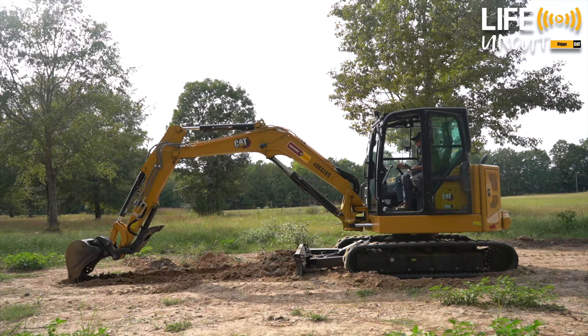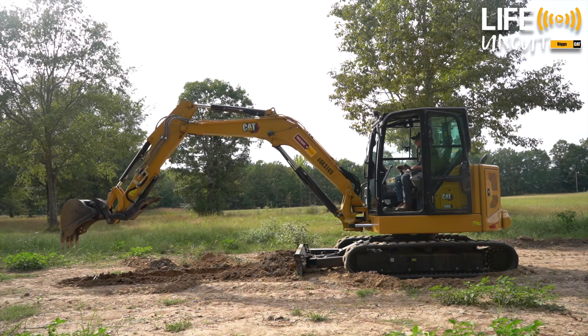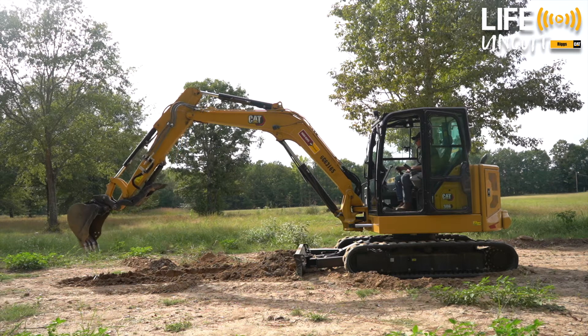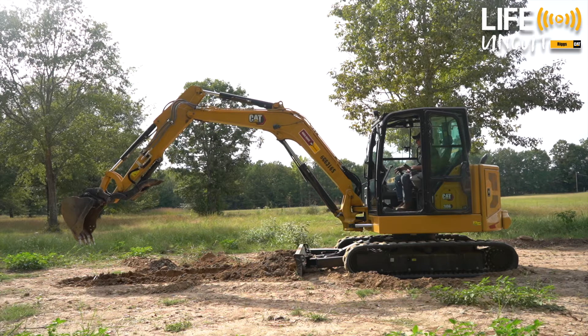So at that point, the right joystick becomes your hydraulic control. You'll have your boom up and boom down, and your bucket control is the same. The difference here is there's a button on the front of the joystick — if we push that, it takes it out of thumb and puts it into stick mode. So now we've got our stick and our boom up and down and bucket all on one control.